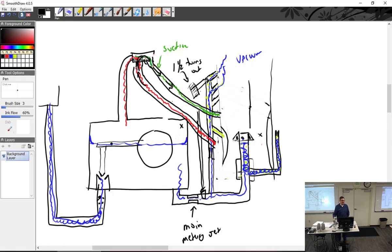So then how exactly are you ever going to set the idle mixture on this carburetor? What? Give it a little throttle. And then what? Well, and then lean it all the way out and have it die. Gave it a little throttle. Now you're no longer in the idle circuit. You're in the off-idle circuit. So that doesn't help you set the idle. It's got to stay in idle to set the idle circuit.